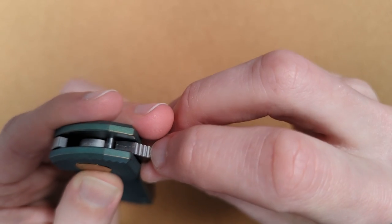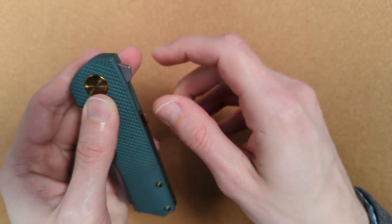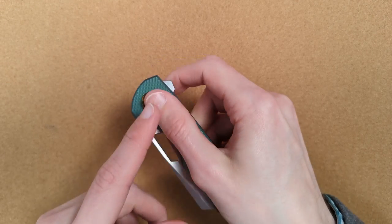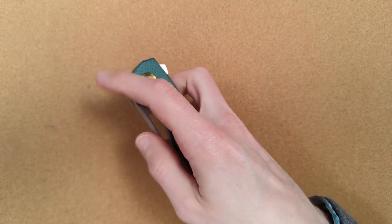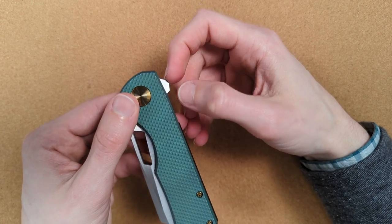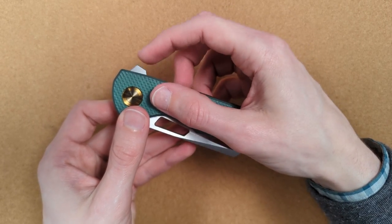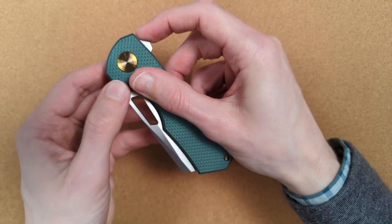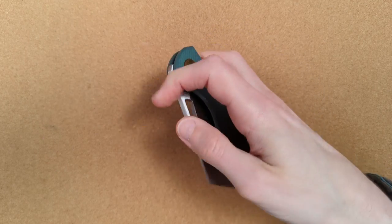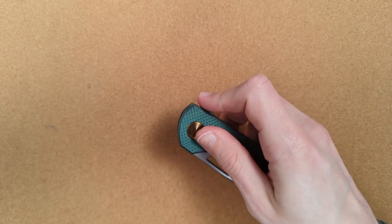This jimping is exactly what you want on a flipper tab — shallow but sharp. It doesn't hurt to press on, but boy does it grip. You can absolutely just pull straight back, light-switch this thing, and it grips well enough. This angle is just right. You're never going to slide off — true dragging light-switch action works without any downward force. This angle also means if push-button action looks like you'd push here, you actually push here, with your angle of force pointing right down. It works really fantastically as a push-button too. Being flattened like that means it both aesthetically works with the shape of the knife and just gets out of your way.